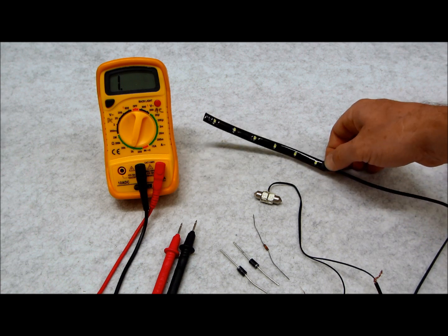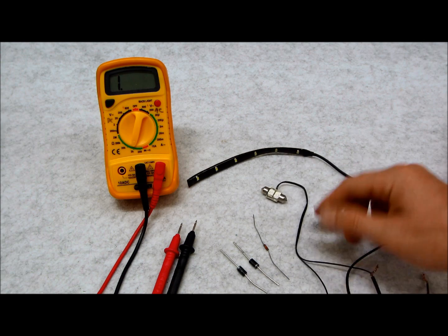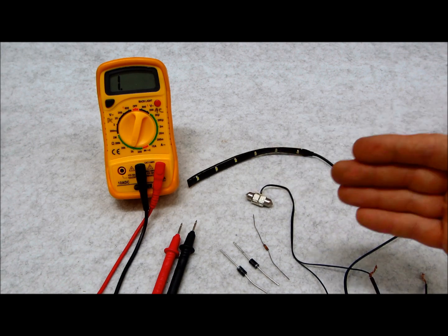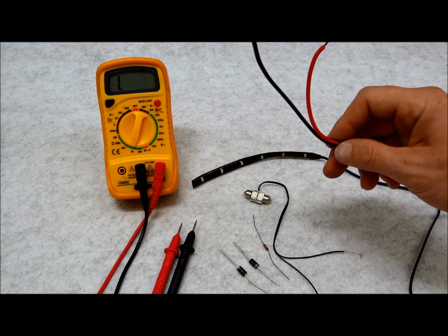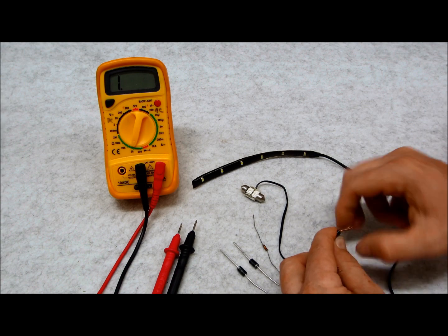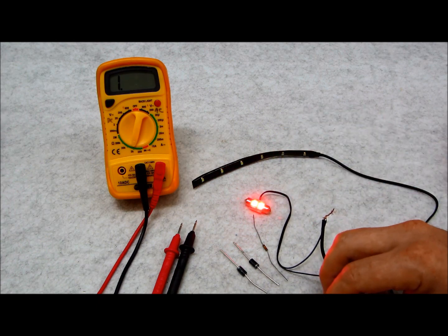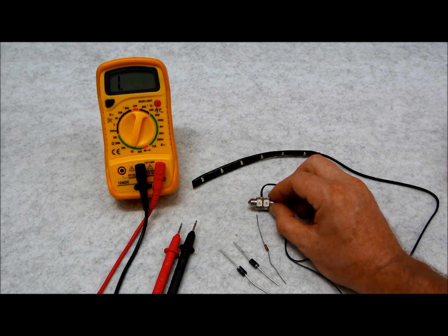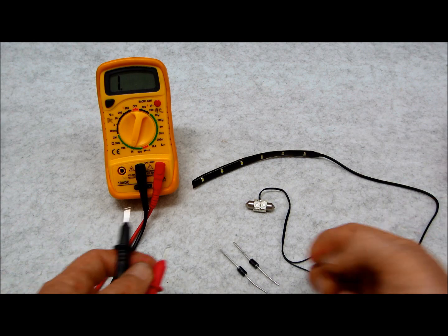I have here an LED strip — a six-LED strip — and another bulb. All of these are just two-wire lights: positive and negative, all 12 volts. If you have one bulb that's a single pole and can only do on and off, here are my two wires from my 12-volt power supply and the two wires of my light. In this video I'm going to show you how to do two different things: a running light giving lower output when the vehicle is running, and when you hit the brake it does that function — both functions with a single-pole light.